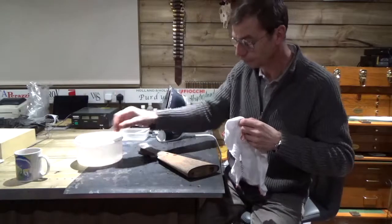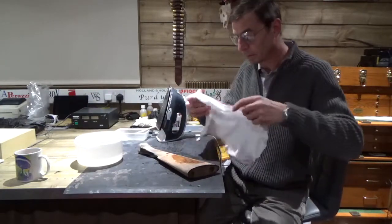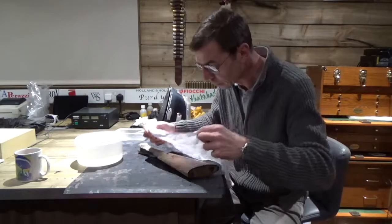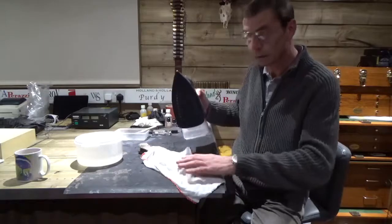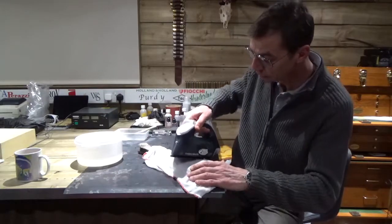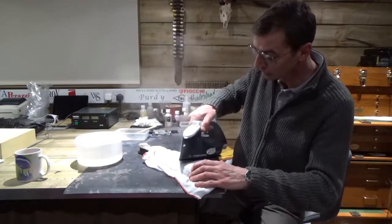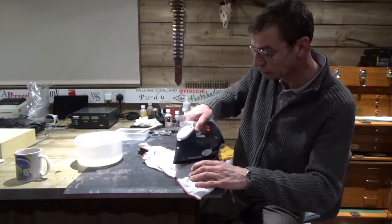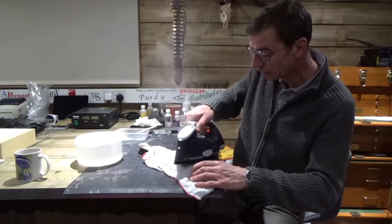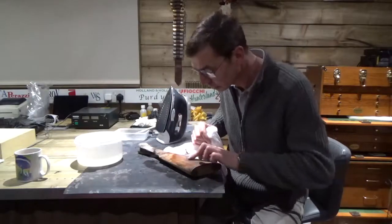So I'm going to take a little bit of water, put it around into the area, and I'll put a dishcloth over it. I've got the iron set on high — red hot — and then a few seconds at a time, steam over it with the iron, just rock it around. Try and hold it in the same place and you'll only mark your dishcloth or your wife's iron, and then that's just trouble. Take that off and have a look at it.